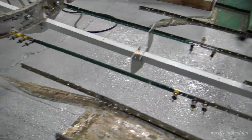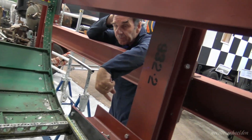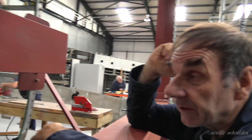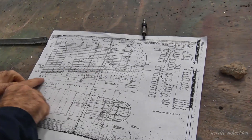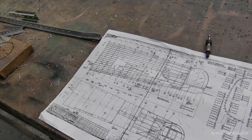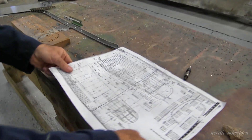So you made a floor jig for where the formers go. Yeah, that's the bottom one. It's not ideal — I'd really like a one-piece one but I couldn't find any material, so I've had to join it in the middle, but it'll work. The one at the top is dead straight but the one at the bottom has actually got a slight curve on it. On the drawing there's a line at the bottom that gives distances up to the bottom of each former, so I had to draw it all out on the floor with chalk, join it, look along it, see that it's curved, bend it to the same shape, and put it on.